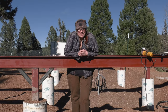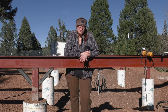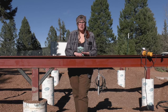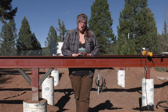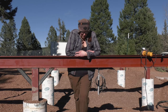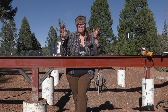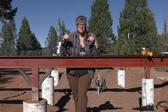It's welding day again, and it's been probably just over a week since the last time we were up here welding. We had some cold weather and some snow, but today it's my turn to weld. I made 90 brackets out of angle iron and I'm going to weld them here — that's how we're going to secure the floor joists to the beams. The plans call for brackets to be 32 inches on center, but we're going a little off script and doing it 16 inches on center. Mike and I aren't super comfortable with just the blocking, and overkill is just right over here.